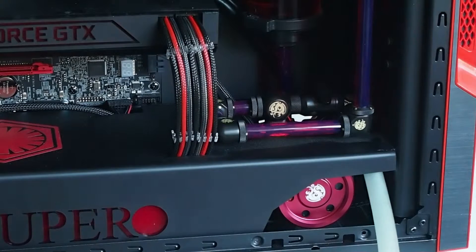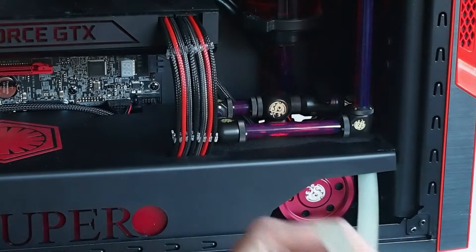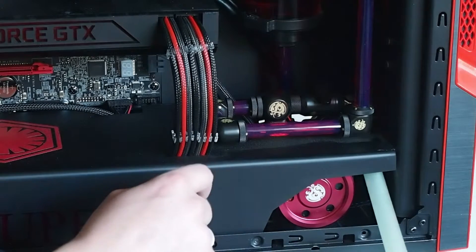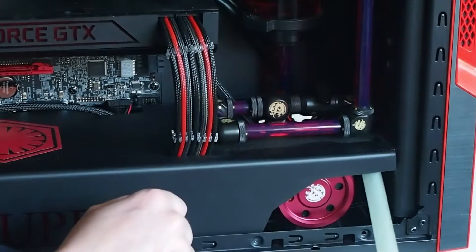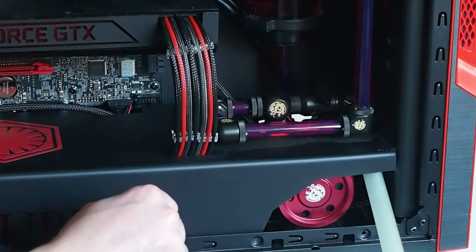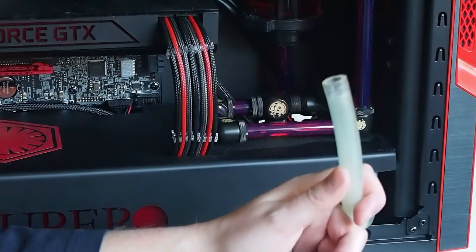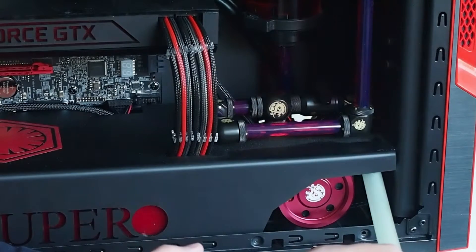This is basically the part where you will be emptying the loop with. If you want to empty the loop, first go to the top of the reservoir and unscrew one of the stop plugs — that way the air can enter the loop. Then put a bottle under the hose into the bottle, open up the tap, and slowly the loop will empty itself.